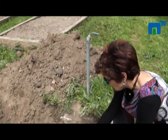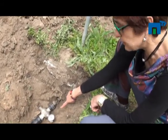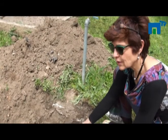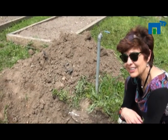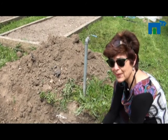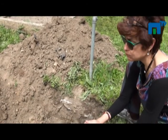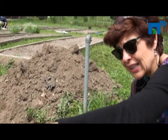This was the point with the pressure regulator and the pressure gauge to know the pressure at this point at every moment. Remember, this system has a pressure over 40 water column meters — even 60 water column meters — because it connects to the general water network of the city of Madrid. If you are located in the suburbs of big cities, you may have to install a pump at the beginning of the whole system.